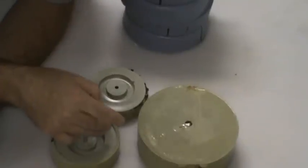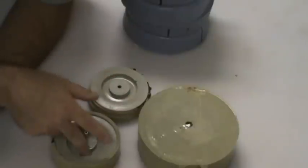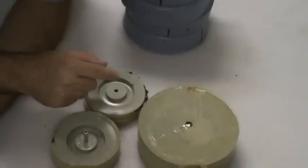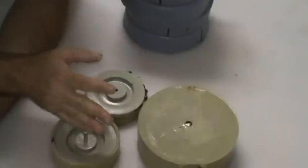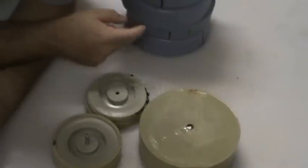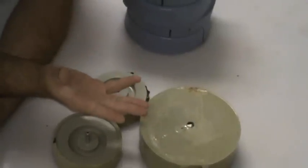So just sit there and keep pouring. Don't let it stop — that's the other key. Small stream, same spot, not on any detail lettering, constant speed, and don't stop. Those four things are the most important. What you want to do is fill it so the liquid has a little meniscus — like how liquid will bulge slightly above the rim of a cup without rolling over. You want that nice little bulge on both halves of the tire. The bulge on the top is very very important. Keep pouring until you get that bulge, then go to your next tire half and do the same thing: small stream, consistent, not over any lettering, don't stop until you get that bulge.